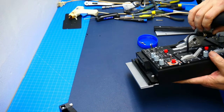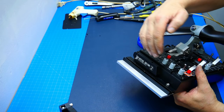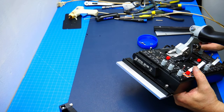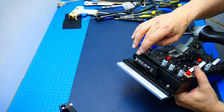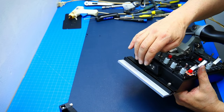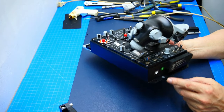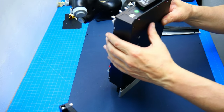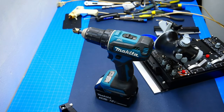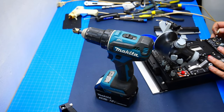We have one through so that I can eventually mount a different, longer bolt in here, make a standoff, and mount something on top if I wanted to. For that I wanted to have some sort of support on this side, and I can use those two screws — inside here is nothing but plastic and a couple of square nuts. I marked 'R' for rear. The first thing we're going to do is chamfer those two holes.